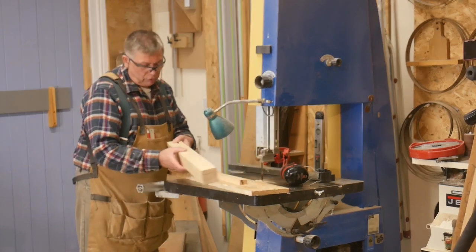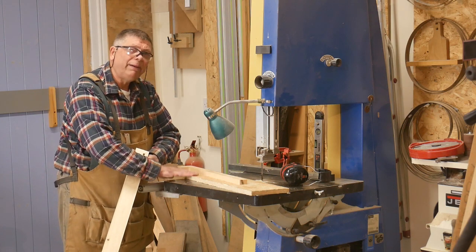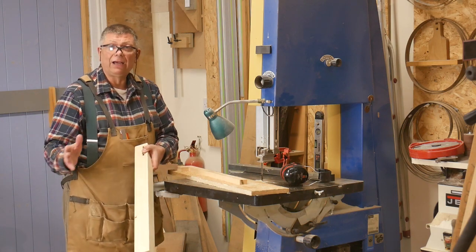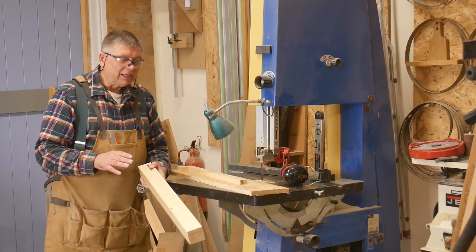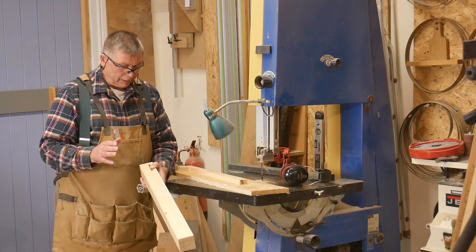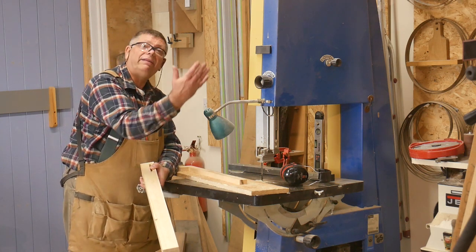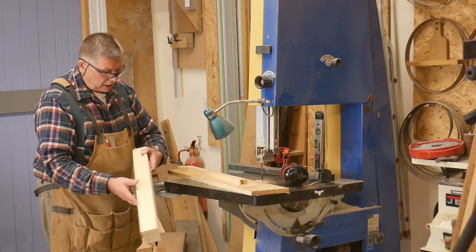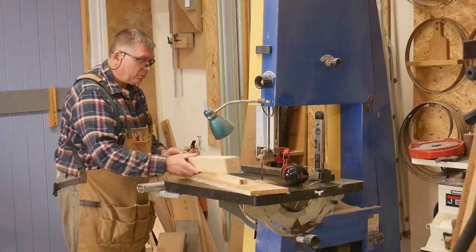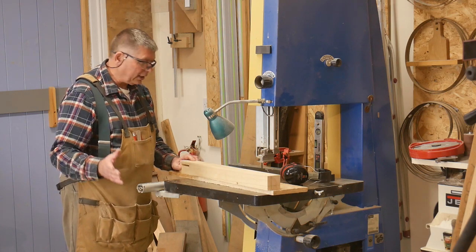So that's all there is to it really. We start off with one mortise against the bed of the jig and the other mortise facing outwards. If you do it the other way around, the second cut the workpiece isn't supported properly — this back end is kicking up a bit, so at the end of the cut the thing kicks up in the air, which you don't want. So mortise downwards against the jig, mortise outwards.